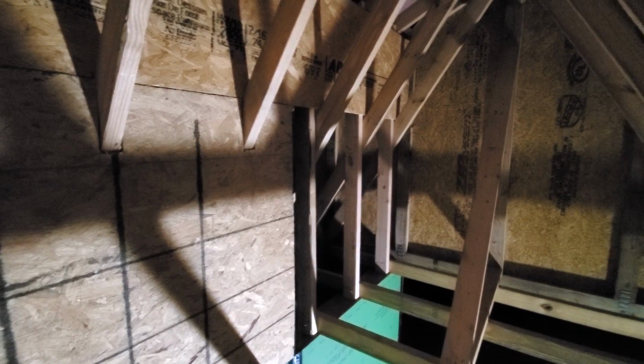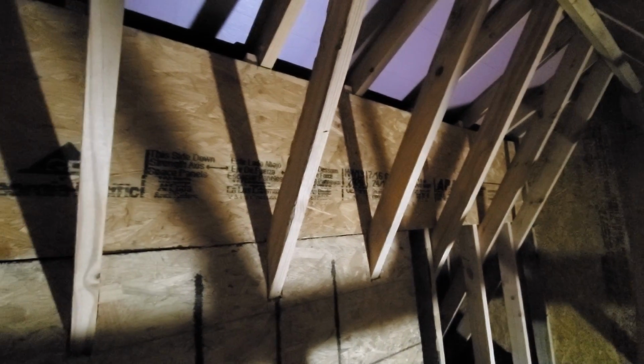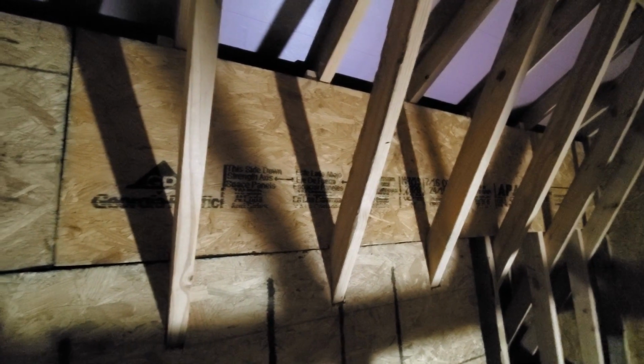Right, so I've got the bathroom wall almost all the way up. Notching this out was a lot easier than I thought. Getting the board up here was harder than notching it out. I've got a little 48-inch piece to do on that corner, I'll take care of that in the morning. But the top piece was no big deal. I just slid it into place, let it notch out in maybe 2 spots, and nailed that in. The gap at the top will get filled with foam. Foam expands enough that it'll fill that.